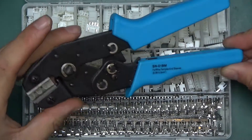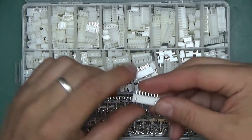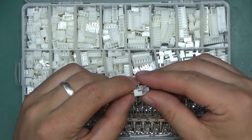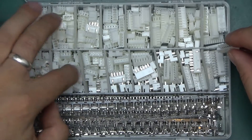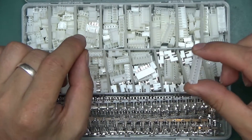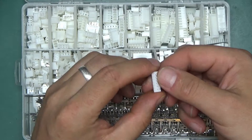Here are the connectors supplied with this kit — I bought the crimp tool and the box of connectors together as one item from eBay; I'll put a link in the description. Those are JST XH type connectors. Without a doubt you are familiar with this type — you've seen it on many products. It's very popular, if not the most popular connector among many electronic items. They come in various sizes; this kit covers two, three, four, five, six, seven, eight, and nine conductor connectors. The biggest one here is nine pin — they can come up to 15 pins but this kit only covers up to nine.